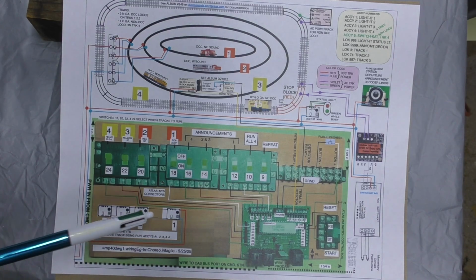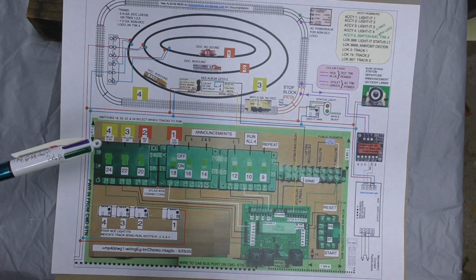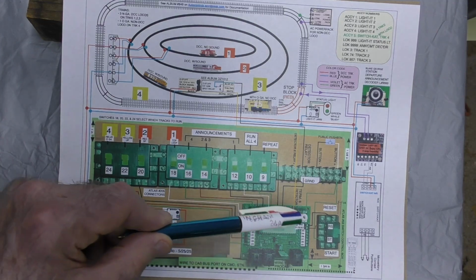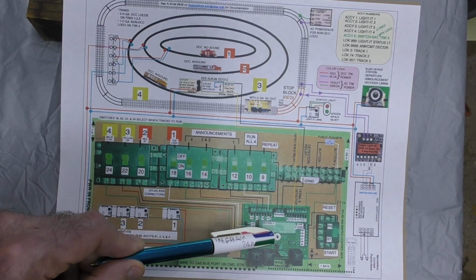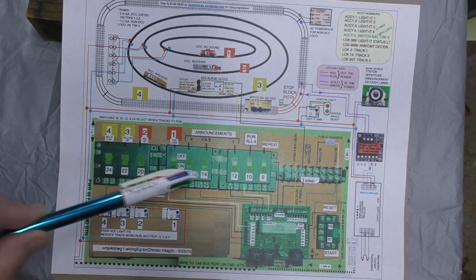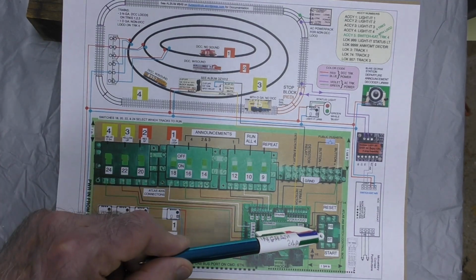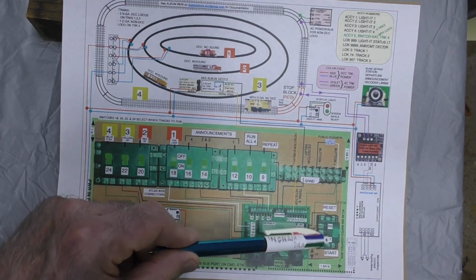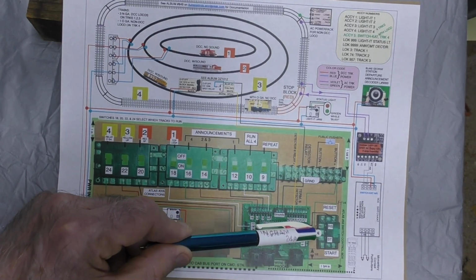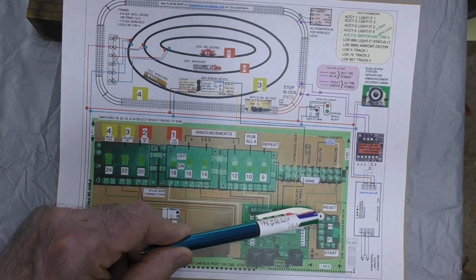Other than the light, this control board is pretty much about the same as the previous 3 or 4 or 5 videos. We've got our programmable train controller, our NCE mini panel sitting here. We got 3 Atlas 205 slide switches, which give us a total of 9 buttons. Then we've got an Atlas number 56 push button switch over here, which we use to either do the start function when it's down here or the reset function when it's up here.